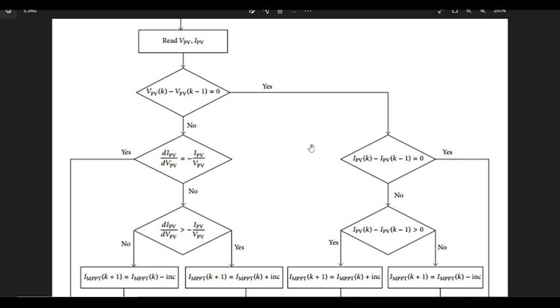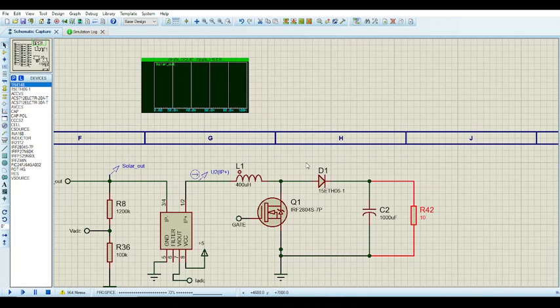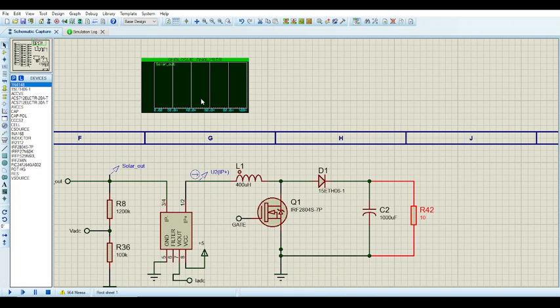And it could actually be done with two sensors. If you decide to put the sensors on the output instead of the input, that's actually great. And I know the output capacitor then matters, or the size of the output capacitor. But it can be done. It's easier with a boost than it is with a buck, from my experience. And in that sense, you are able to increase the efficiency of your charge controller system. Fewer components are required, and that's great if you are able to do it.